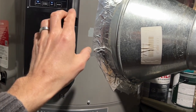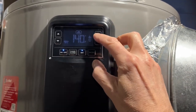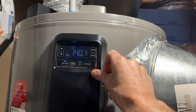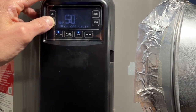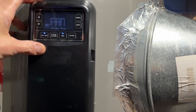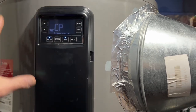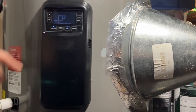You can't actually see what the temperature of the water is without going into a special mode. To get into it, press Mode and Next together — there it is. You can see options: shut-off valve test, evap fan, and then compressor. This is how you test the system — Mode and Next gets you in, and you can see the compressor starting to run.